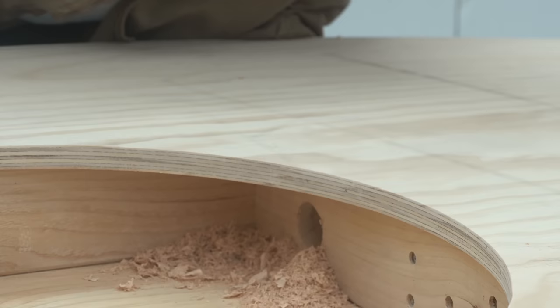As a nice finishing touch, I loaded a roundover bit onto my router and put a roundover on the top and bottom of the plywood — this just improves the overall look and feel. I did this in between sanding 150-grit and 220-grit. I applied two coats of water-based polyurethane to the bottom of the table and the frame, then three coats to the top with a light sand using 320-grit before the third coat to get any bubbles or imperfections out. I'm using a foam roller to apply this — it's what I prefer for tabletops, as roller marks are more consistent than brush marks.